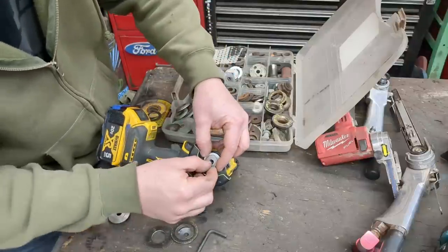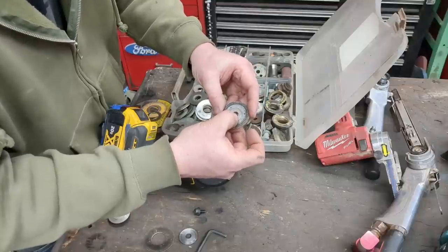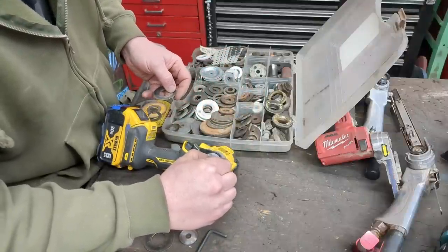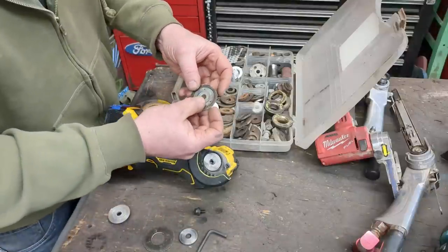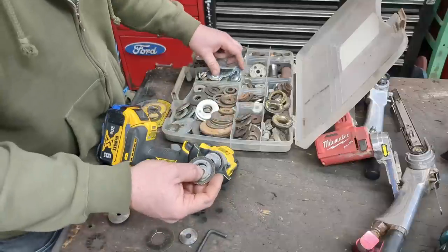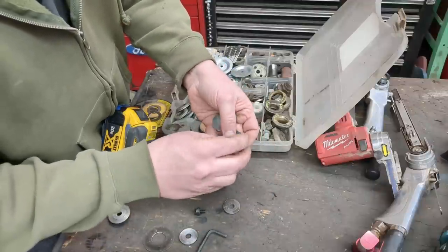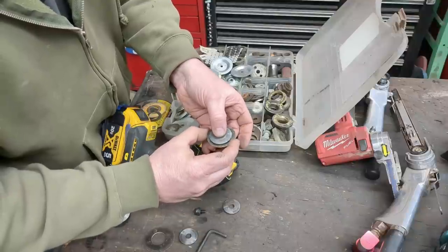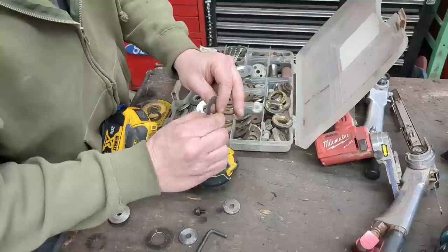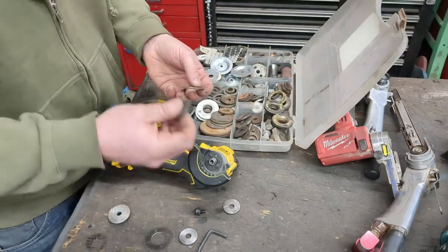Here's a washer with a random 3/8-inch hole in the middle — which is pretty close, good enough. I don't know exactly what size this is; it's a 3/8-inch inside diameter washer, actually fits perfectly, so it might be like 5/16 because they usually bump them up. But this washer fits in there perfectly. You could get another fender washer with a 3/8-inch hole, put a washer on, stack that, put that on, put another fender washer on, and you're done. Even if you're a little bit off, just grind it lightly for a minute and it'll be perfectly smooth. The only thing is this washer has to be just barely thinner than the thickness of your blade, so you may have to sand it down just a little bit. That modification — super simple — allows you to utilize junk blades indefinitely.